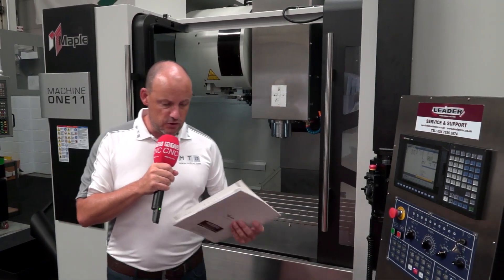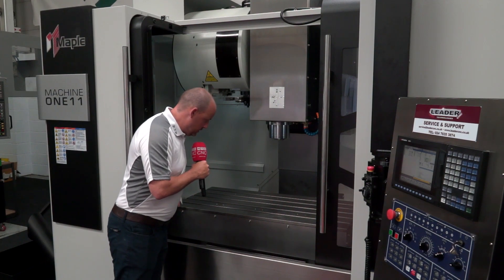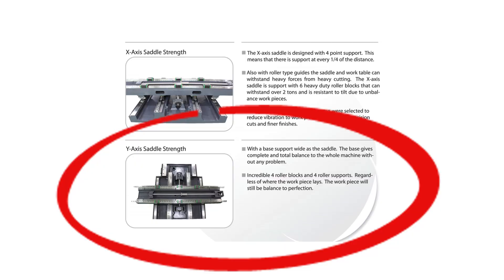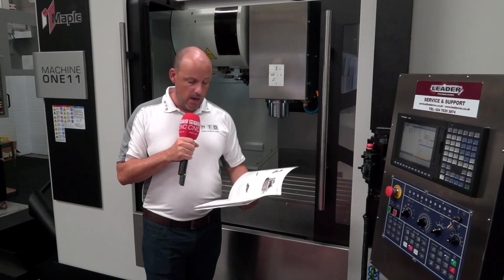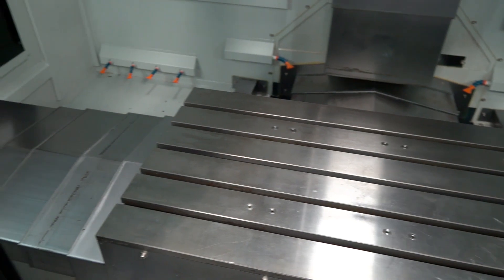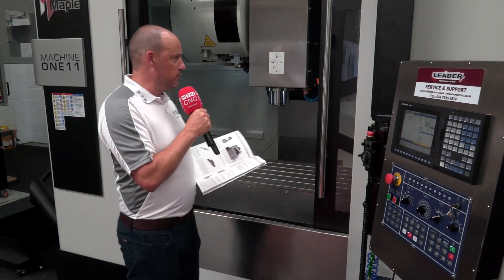The strength of the machine is another key factor, and I'm going to open the brochure to talk about this in more detail. This machine has an X-axis saddle supported at four points — one to the left, two centrally, and one to the right. The Y-axis also has a base support as wide as the saddle, giving complete balance to the whole machine. The brochure highlights four roller blocks and four roller supports on the Y-axis saddle, dampening and dispersing weight and machining forces.